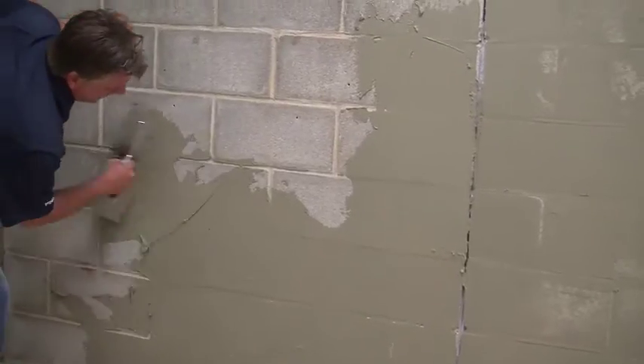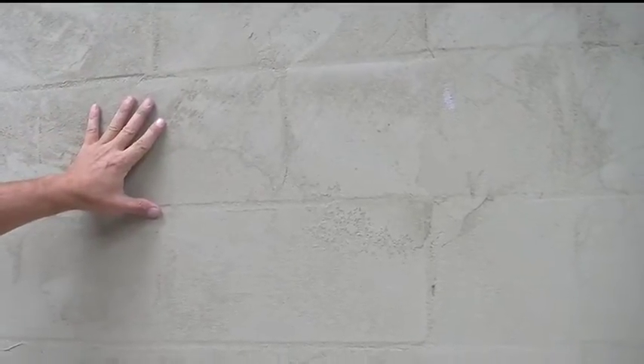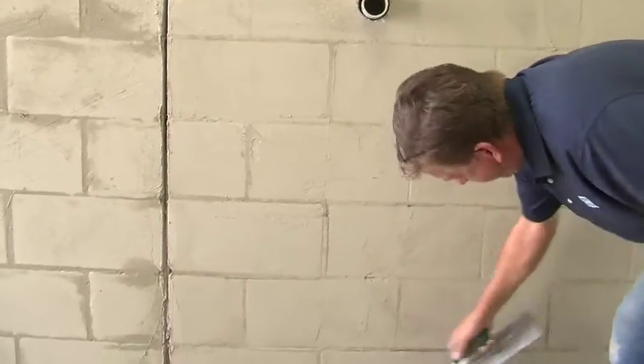Try to keep your construction joints in the wall as clean as possible — it'll make things easier when you're treating the joint afterwards. When you've completed the skim coat and it is cured, use the flat edge of your trowel to smooth over the entire surface, removing any mortar peaks left behind.